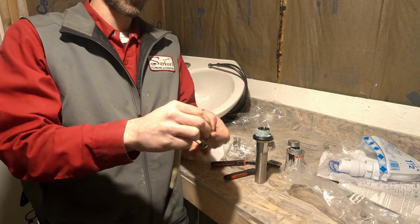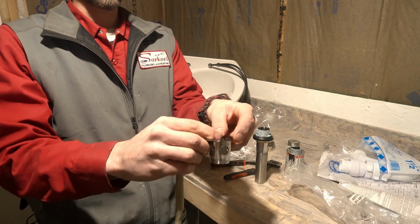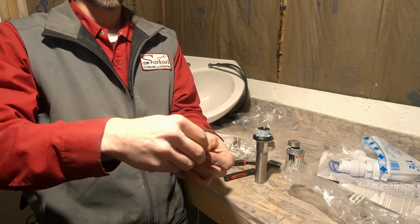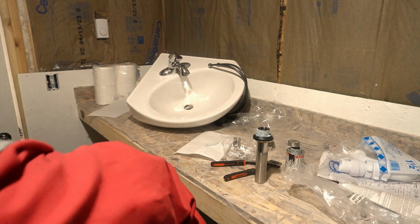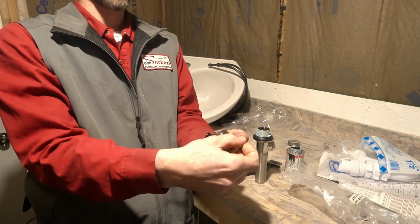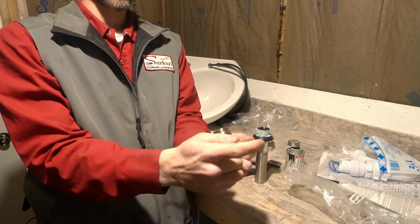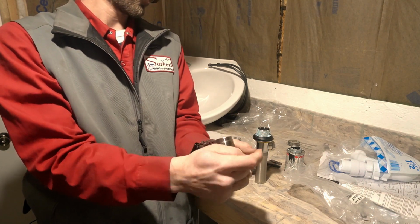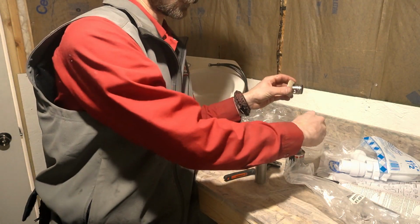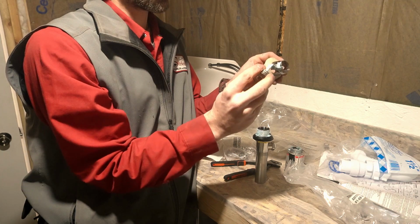Keep stuff clean. And that goes around this rim here, which is the very top rim that goes into the sink. Nice little loop-a-doop around there. Squeeze her on so she ain't gonna move or come loose. And you want it to be nice and warm. So get it nice and warm. Then on these threads right here, need a little bit more pipe dope.